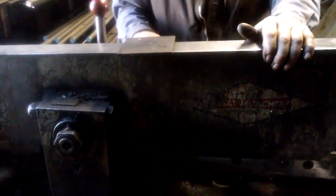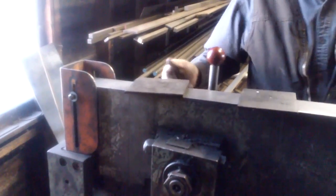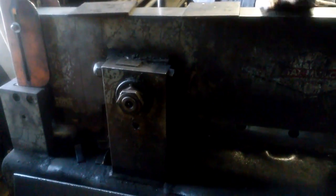So you're going to cut this? Cut that right off. All right. Oh, wow, look at that. I thought it was a saw. It's a little bit faster than sawing. Yeah. Probably cleaner, too. It can deform the edge of it sometimes. And capacity is, it'll take a 1-inch thick, six-inch wide piece of steel. Oh, my God. And sheared off just like that, what you just saw.